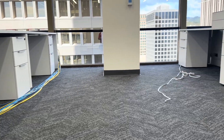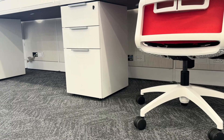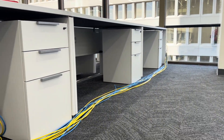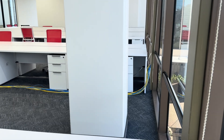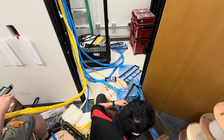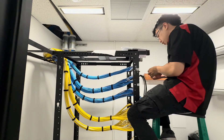It's pretty common that not all of the furniture arrives and is assembled at the same time. In our particular case, there's going to be some furniture delivered in a couple of weeks. What we're going to do is leave those cables roughed in, but we will put connectors on them and we will test them and label them to make sure that they're operational. People will be sitting at these desks even though it's not completely 100% built. When the final pieces of the furniture are brought, we will come back and thread them through the base of the furniture again. While the team members wrap up doing the furniture and faceplates at one end, at the other end in the server room, someone needs to keep pace with that installation by finishing the patch panels.